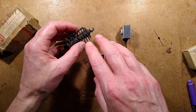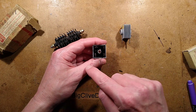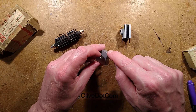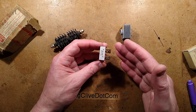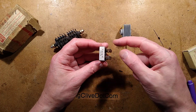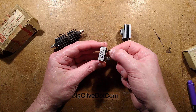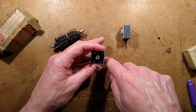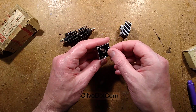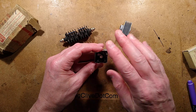You'll find the four connections on the big selenium stack: two from the transformer, one positive, and one negative. In the replacement module, the pins all go one direction except for the positive, and the negative is diagonally opposite. In the panel, you literally just drill a 3mm hole, put a self-tapper in, take the connections off the original selenium rectifier, put crimp spade receptacles on, and press them onto the new rectifier — and that's more or less it, but there's something you should know.